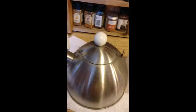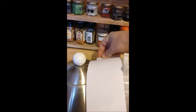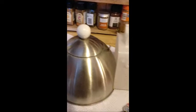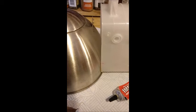And the idea is that this is going to have to be shaped over that awkward gap, and I'm going to have to work out a template first by making it in paper, and then possibly by making that in card later on. But first, I've got to allow that contact adhesive to set fully. It sticks together after a while, but it can take an hour or more to go completely hard.